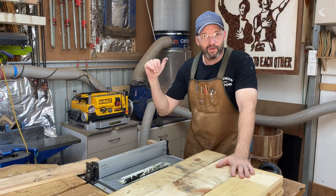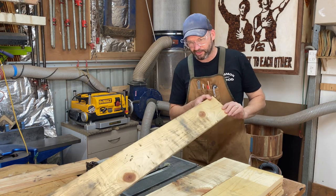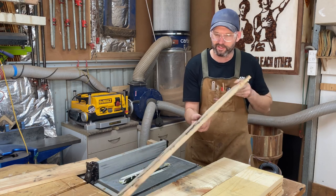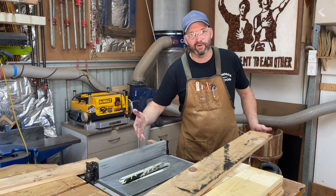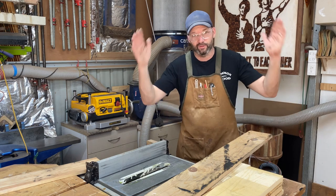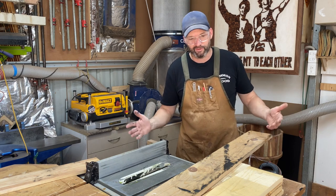It's actually been a long time since I made the other parts. I'm now gonna make myself a dust bin. I had one pallet — pretty much — and it's pretty grubby, just a pine pallet, but it's nice and thick, so I'm gonna be able to get four staves out of one board. I've set myself up at about eight degrees, just gone off a stave calculator. This one's pretty straightforward because it's a cylinder. I'll whip all these pieces through the table saw, get my angles, and we're pretty much ready to glue.